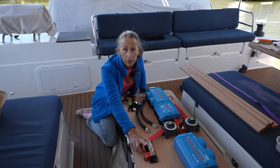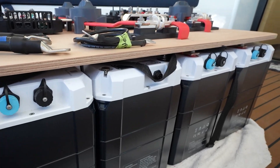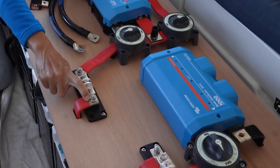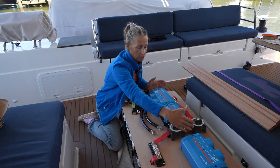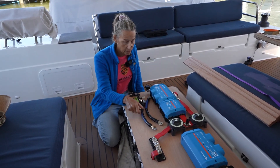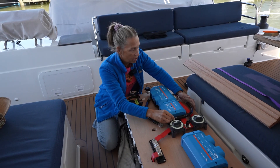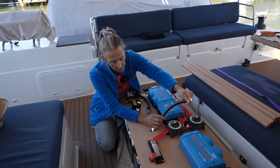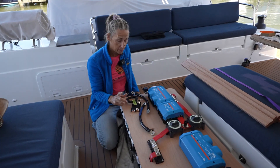This is actually a Z-bend. This is the positive terminal on one of these batteries and it's screwed in underneath here — it comes up like that. This goes into one side of the fuse, comes out of the fuse, and goes directly into my main switches. This section is the 24-volt, this section is the 12-volt. In the areas where I couldn't use bus bars I built four-aught cables. This is the negative in on the shunt — it travels underneath the table through these holes. They connect to the negative terminal and connect up here, so that worked pretty well.